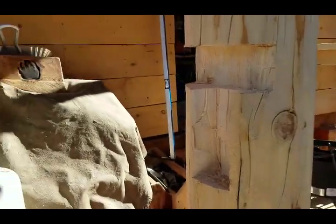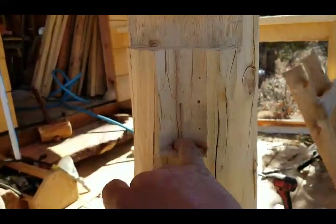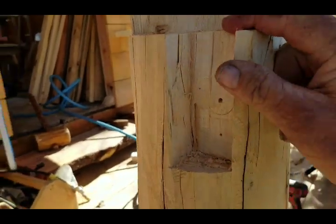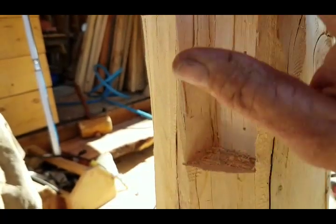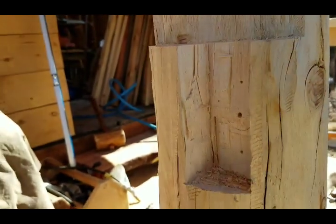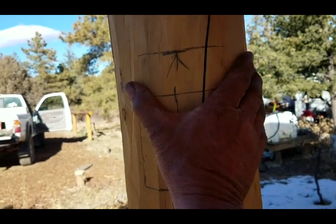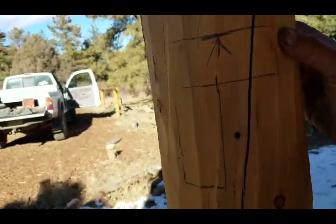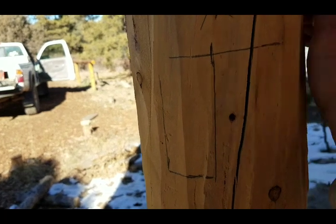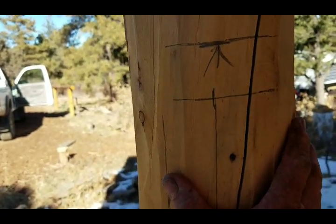In the case of this pair of joints it's going to be filling in, so you'll never be able to get a piece in that's the full length - you have to make them just a little bit deeper. If I cut it a half inch short of the full length and wiggle it around a little bit I'll get it so it's visibly hidden. Then I'm just going to cut a little shim and drive it in behind it on both ends to keep it tight. The top rail will just slide in from the front. On the corner here you're going to have one coming in this way and then one coming 90 degrees this way, so your two pieces are going to touch on that inside corner and these two mortise joints are going to line up.